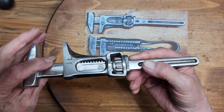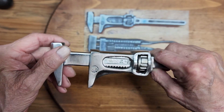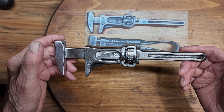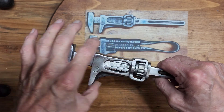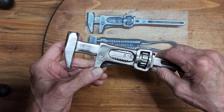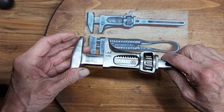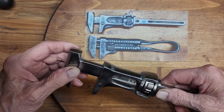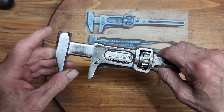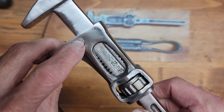Basically I went with just a brushed finish on it — enough to get all of those rough edges sanded down and smoothed. I did a lot of wire brushing. First I wire brushed it on the bench grinder, then I took it outside and used my cup wheel — a real coarse wheel with my grinder — followed that up with a finer cup wheel and gave it a good thorough working over before going to my sander to get it smoothed out. But I did make a goof here. You can still see the International Harvester logo, but I made a mistake on it.